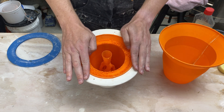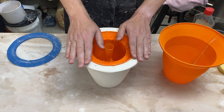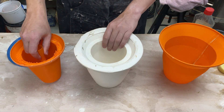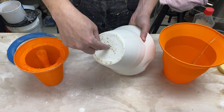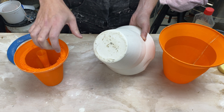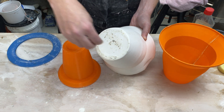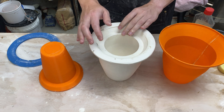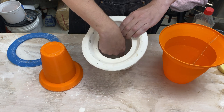The original suggestion was using dry ice. One of the follow-up comments suggested using a mix of water and acetone or isopropyl alcohol. The idea is it drops the freezing point of the liquid well below the freezing point of water so I can actually get it as cold as my freezer — that's about zero degrees Fahrenheit or negative 17 Celsius — and hopefully have it shrink just a little bit enough to pull it out. The last idea is to actually put a hole in the bottom of the mold and use air to blow in and hopefully break the vacuum and push this mold out. I'm going to call that one plan B, as it could potentially create a small defect in the bottom of the pot.